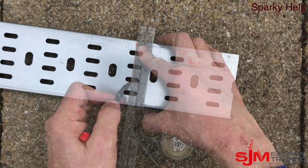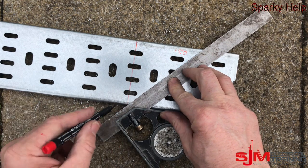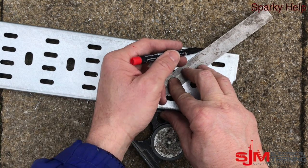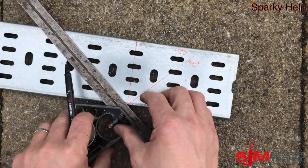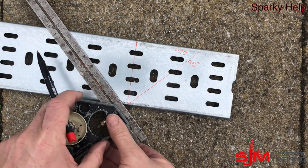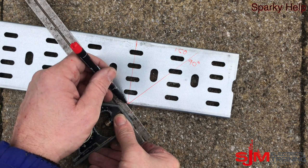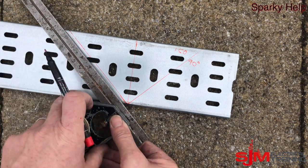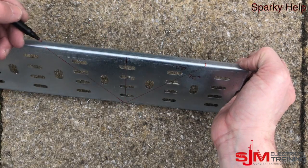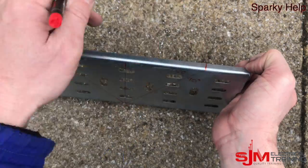Make sure you are aware which direction you wish to turn. Do a 45-45 — remember, if this tray is too big, then the width of the tray: that measurement at the top there is 100, which is the size of this tray. So you could just measure 100 in either direction and that would give you the 45s. We've marked that, and mark across the edges because we're going to remove those lips.